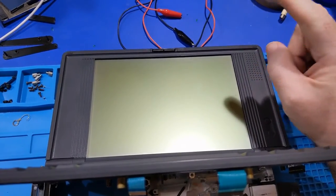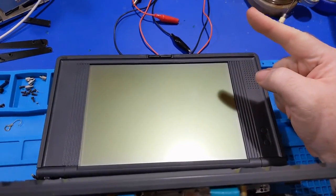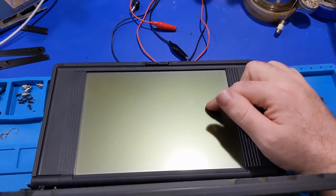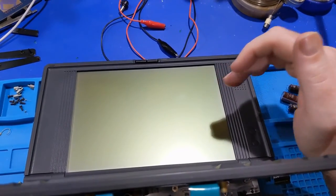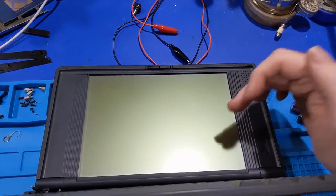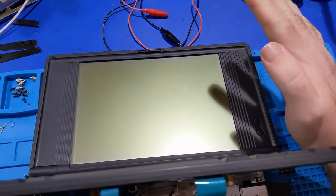Not all of them are the same. What's being sold online right now - I can get the film for this - I can get all different types including reflective and transflective film. Transflective is reflective but also allows backlight to come through, but this one's not a transflective display, it's a reflective non-backlit display. You can still get the film, but it says in the description that the film is PVA-made and it's good for up to 20 years. So it's the same exact material - even when you replace this, it's going to do it again. Until someone comes up with a solution that's just regular plastic, this is going to keep happening.